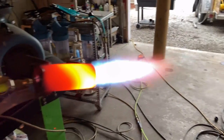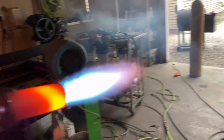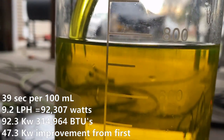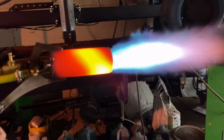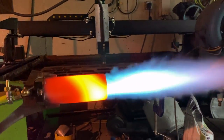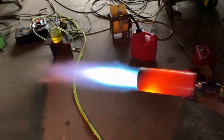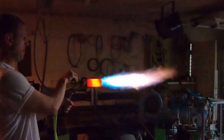The whole premise of all this testing was to outperform the Zeus burner, which I am currently using in the steam machete that I sell. So we had to beat 37,000 watts — we did that in the first video at 45,000 watts. However, I had a hunch that altering the geometry of the annular air orifice would enable us to achieve a high-velocity flame with far more power and the same combustion chamber, but it would keep us from having these flame-outs. Pretty much smashed the objective on these tests.